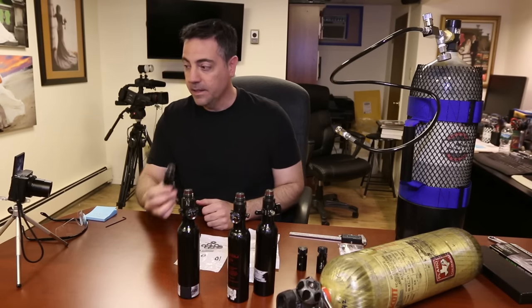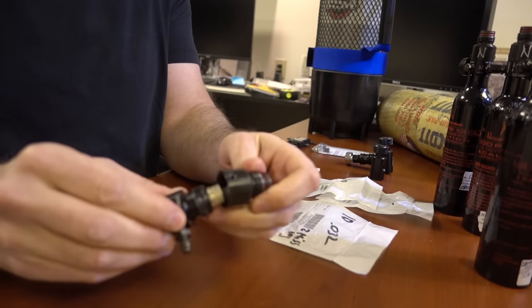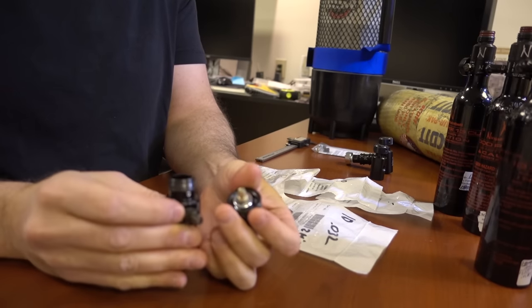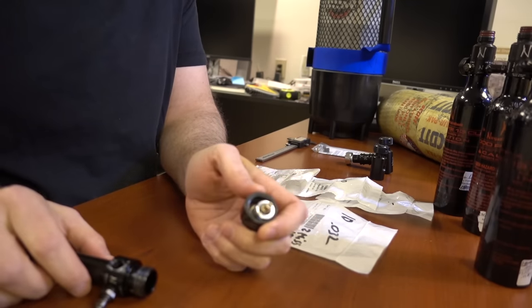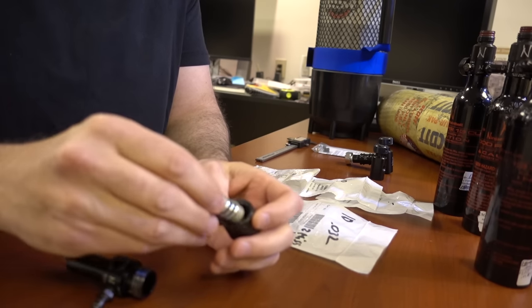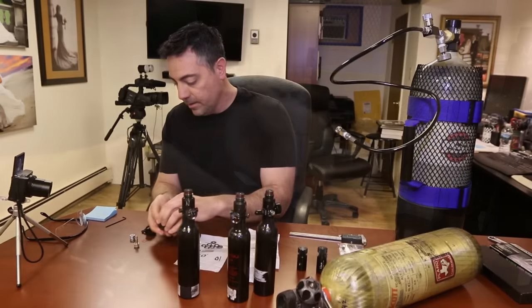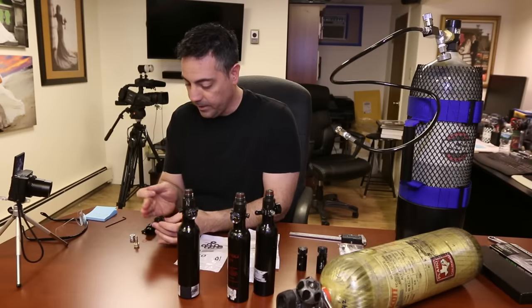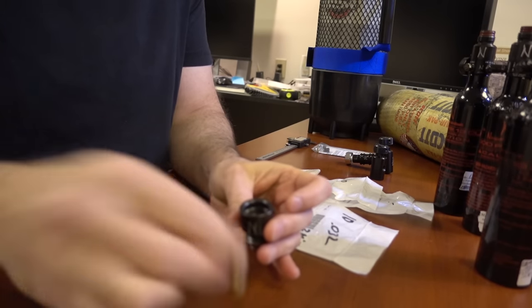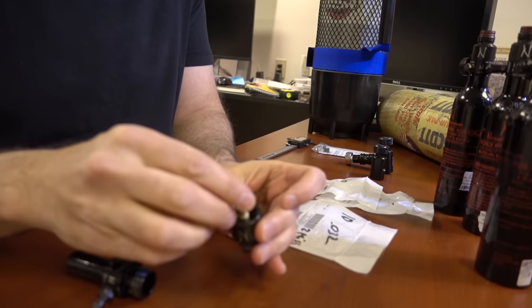Here is a valve from an older bottle — I'll show you what's inside. Unscrewing this reveals the bottom piece with a shim — a 0.021 shim. On the other side you have a spring, a piston, a light spring, and a ball bearing. That's the top part of the regulator. The ball bearing goes in, followed by the spring, followed by the piston.